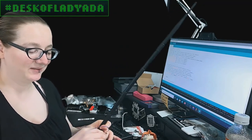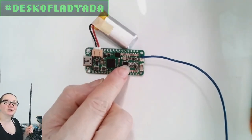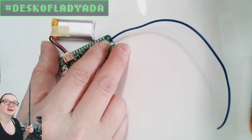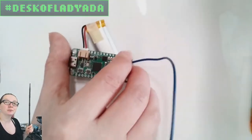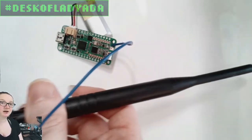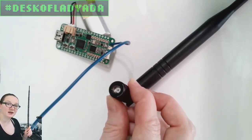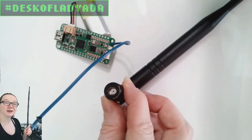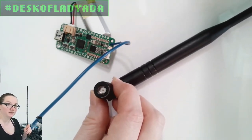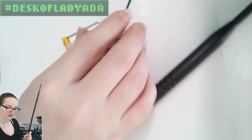Let's go to the overhead. So on this design for a 900 megahertz radio module, we have a low-cost antenna option where you just solder a piece of wire. We have these spring antennas that are like a couple cents. You solder them into a through-hole port, but let's say you want a really big antenna — something panel-mounted that you can connect to the outside of a box, waterproof, with just the antenna sticking out. For these, you'll want to connect an SMA antenna. That's the most common for 400 to 900 megahertz antennas. Almost all use SMA for the connector. They look like this, and you need something that takes this and lets you plug it into this micro-UFL.